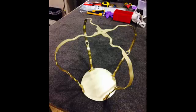So I decided to try a technique I'd never used before, which was to actually stretch a hole directly into the arm of the mount. When I started construction on the arms, I made sure to use a strap thicker and wider than I needed, so I'd be able to grind them down later to the exact taper I required. So I was confident I had enough brass there to form a hole around the nuts and still maintain the rigidity I needed.